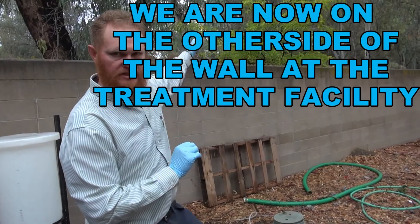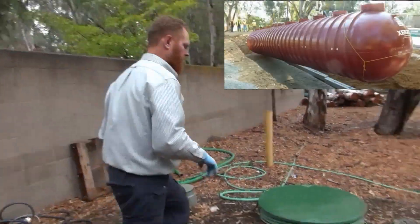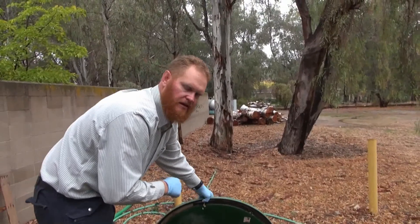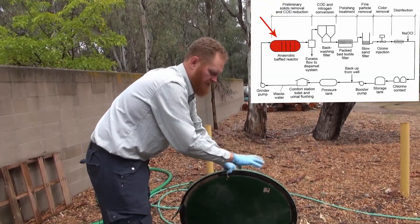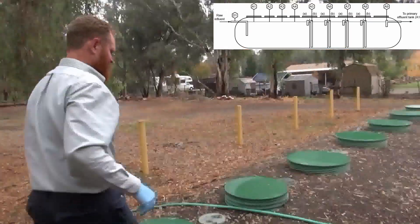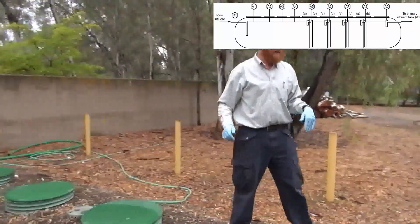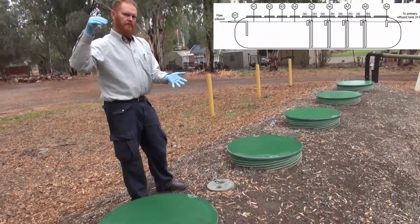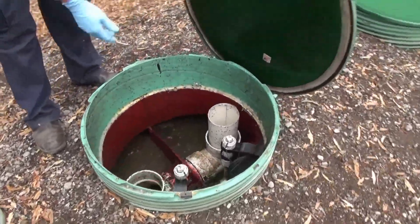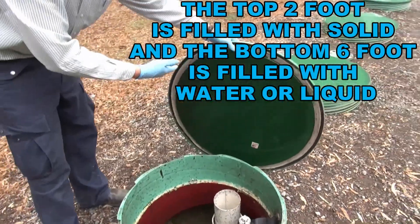Water is coming from the comfort station into this tank, where we're settling the solids out of the water and making the water clean enough for the second stage of treatment. We can see all the solids accumulating — the solids are breaking down with the bacteria in the water. We're also spraying water in here to break the solids down further and help mix the system. This tank has five compartments: one large compartment of about 6,000 gallons for storing solids, and four smaller compartments where we flow the water from the bottom to the top and contact it with anaerobic bacteria for better treatment. The water flows from the top of one compartment to the bottom of the next, flowing through bacteria that live on the bottom of the tank.